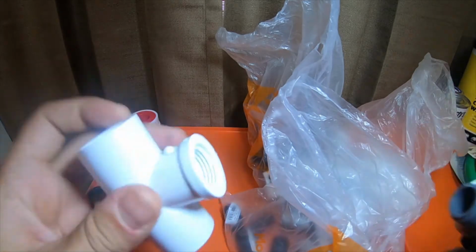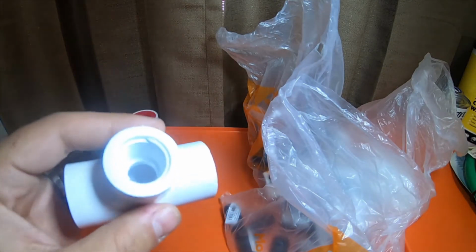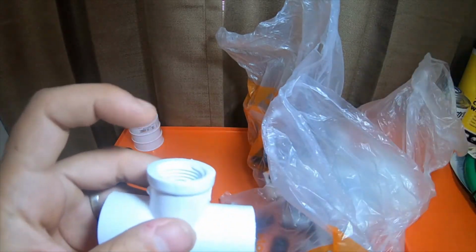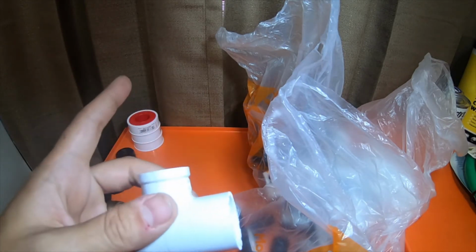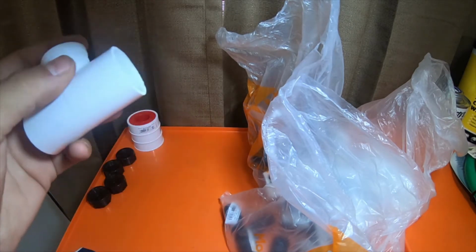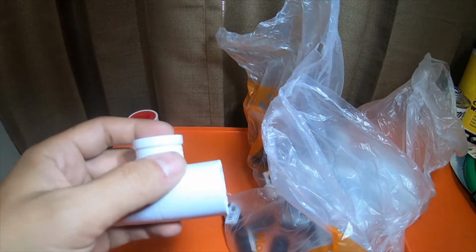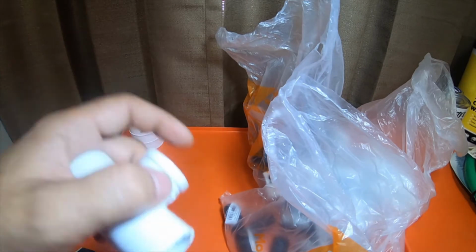which I still had to grab the 3/4 smooth, the 3/4 smooth to the 1/2 inch thread, but I was able to dumb it down a little bit, not have this thread in here, plus a Shark Bite fitting on this side, plus a black hose, a 1/2 inch irrigation tube, and then poking holes in an irrigation tube to fit the 1/4 inch nipples to hold the 1/4 inch tubing for the drip system, because then you also need to put a nozzle at the end of the 1/4 inch tubing, whether it's a spray nozzle or a drip nozzle.